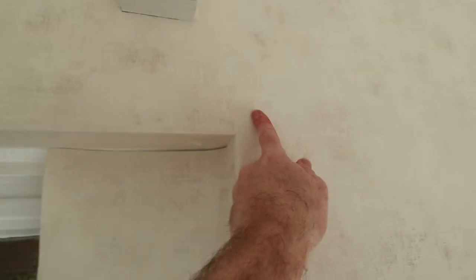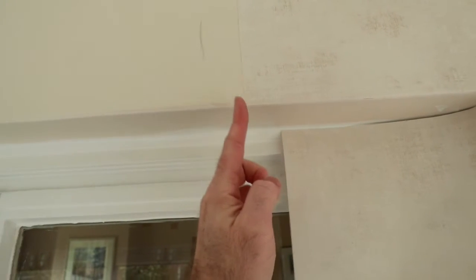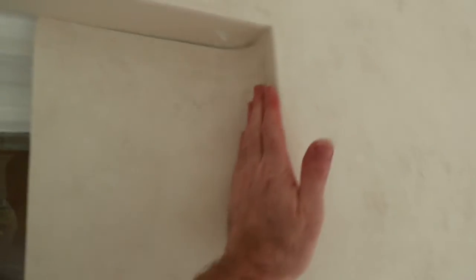So can you see what I've done? I've had no splice there, I've had no splice there, and the final piece will be a filling piece there. But you do that filling piece after you've got that length on and you've already got the joint there to butt up to, and I'll show you that when I've got that one on. So are we all good? Are we understanding it? I'll show you when it's finished. Thank you.